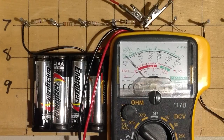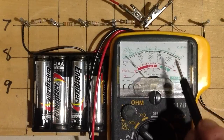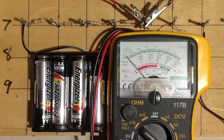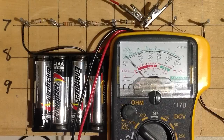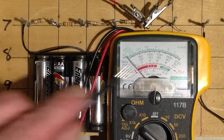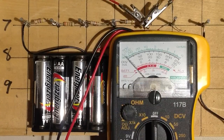It will at least give you a ballpark estimate when you measure ohms. The thing to remember about any analog ohmmeter is that what you're really measuring is current. You have a battery and some series and parallel resistors connected to a micro-ammeter. If the battery starts to go soft, you'll have trouble measuring ohms because the zero ohms adjust won't reach zero — you'll need to replace the battery, and you'll know it because it won't zero out anymore. More current means less resistance, regardless of the switch position. When you're finished, turn it off to save that battery.